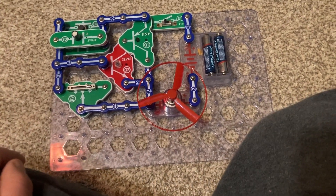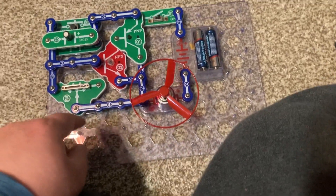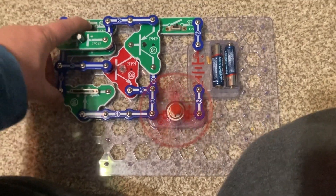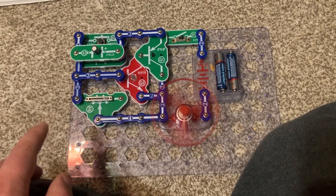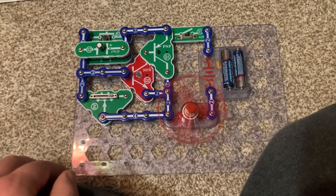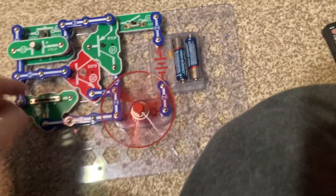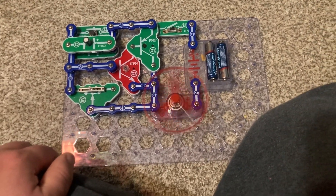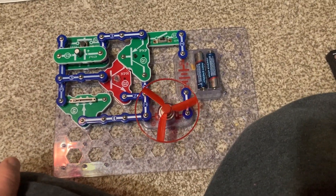For a variation of this project, I've placed the C5 capacitor directly over the C4 one. When I turn on the slide switch and push the press switch, with the adjustable resistor on its highest setting, the fan and motor spin much longer. That's because when connected in parallel, the two capacitors supply more energy to the fan and motor. On the medium setting it will run longer than in the previous project. However, on the lowest setting, the fan and motor will still only spin at full speed as long as you hold the switch down.